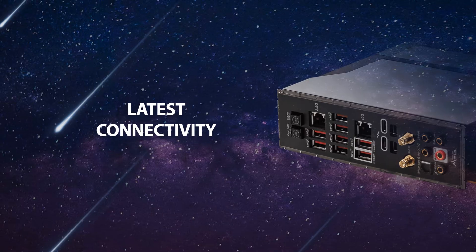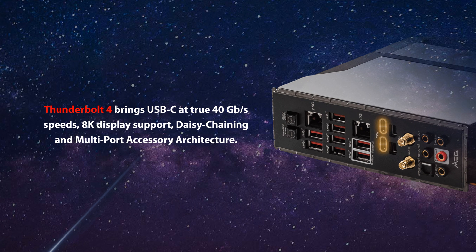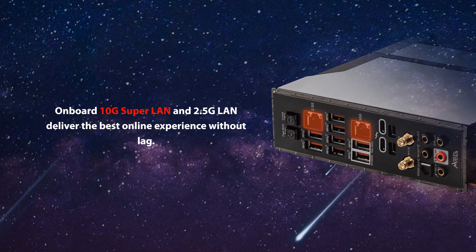And it gets even more insane when you look at some of the other I/O. Starting off with rear I/O here — this is the stuff of dreams. This thing has eight USB Type-A ports, with literally none of them being USB 2.0. And add to that two USB Type-C connectors, both of them being Thunderbolt 4. Add to that two mini DisplayPort connectors, Wi-Fi 6E, two Ethernet RJ45 ports — one 10 gigabit and one 2.5 gigabit. Most people won't even need that, but it's there. Why not? It's the king of all motherboards.